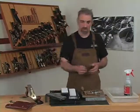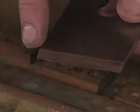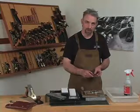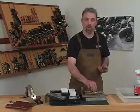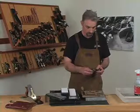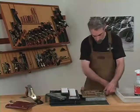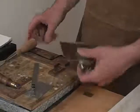If you have a blade that's gotten a nick or the secondary bevel has grown to a point that you no longer want to polish all that surface area, you can re-grind the blade with a low revolution grinder or your honing guide and some coarse grit sandpaper. 80 to 150 grit is a nice range for working that edge. If you're going to use the honing guide, set your primary bevel off the 25 degree stop and go to work on the sandpaper.